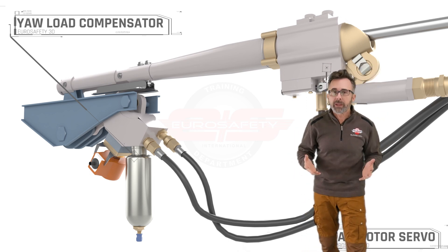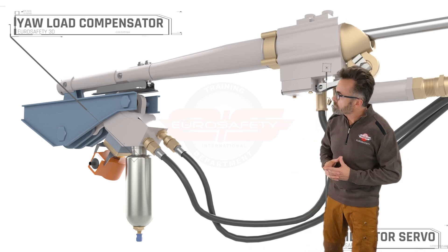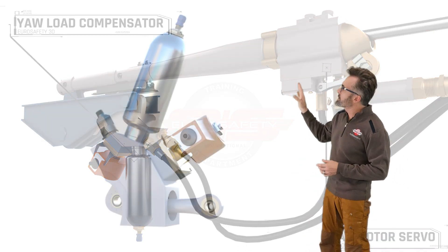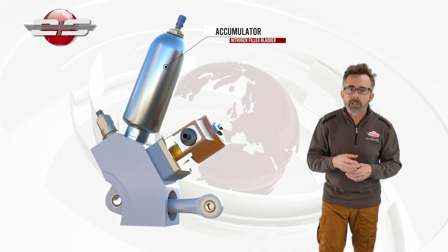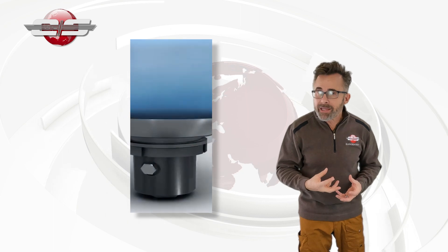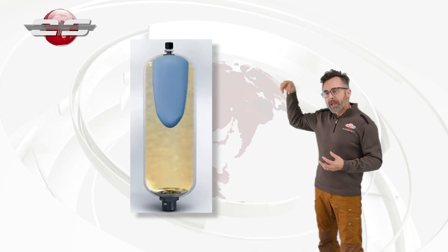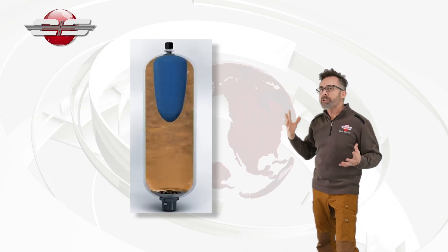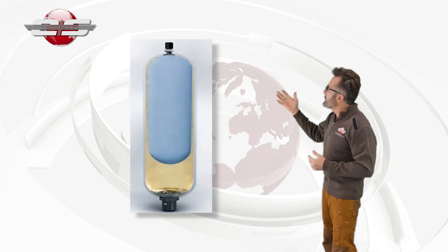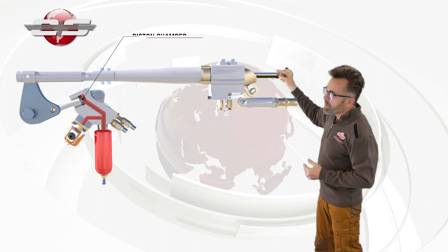Something like if you're real heavy or you had to make big movements with the pedals. How this system works is you have an accumulator, which is simply a metal cylinder with a rubber bag in it filled with nitrogen, and we pump hydraulic fluid in around it. As we pump hydraulic fluid in around it, it collapses that bag, and then the bag is trying to push the fluid out for the rest of the time. The fluid pressure is routed to this piston chamber.